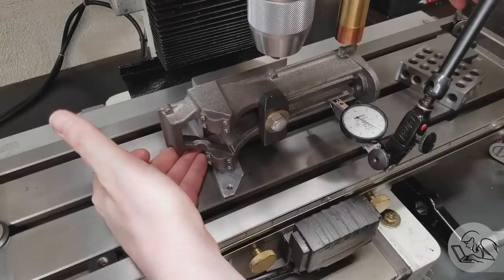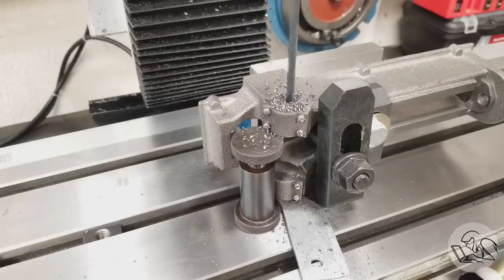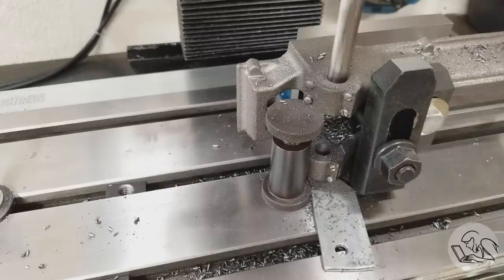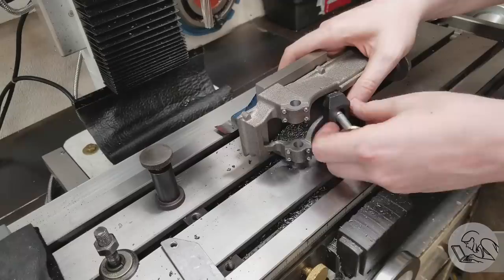Big moment: time to create the main bearings. I very carefully indicate and align everything, measure the bearing positions, then center drill, pilot drill all the way through, drill one size under final dimension, and ream to final dimension for precision. Getting this perfectly aligned is difficult and depends on how well you machined the base and caps — which I didn't do great at. The final bearing isn't super well centered but it's certainly functional.